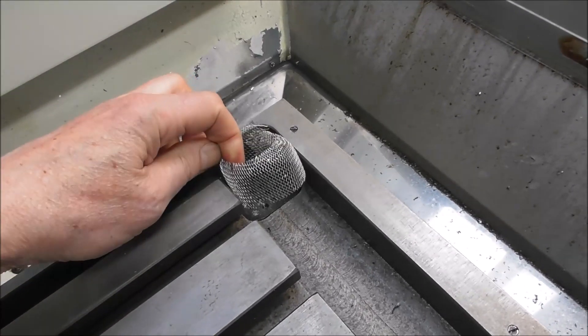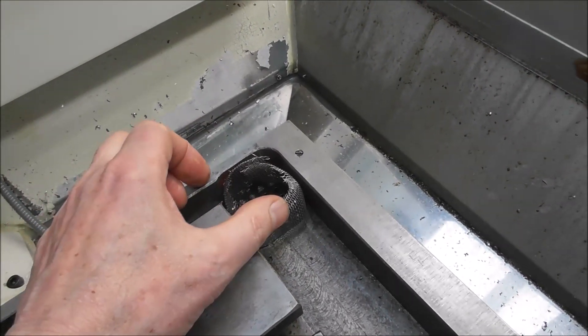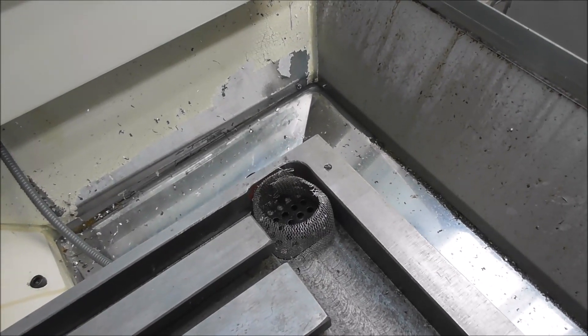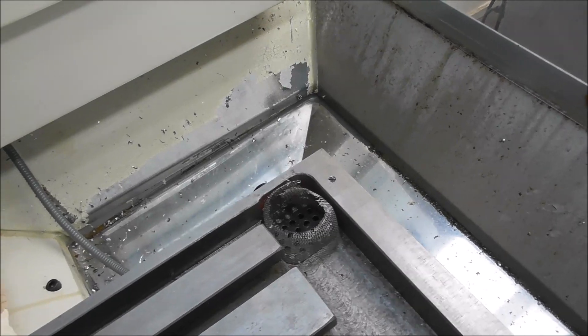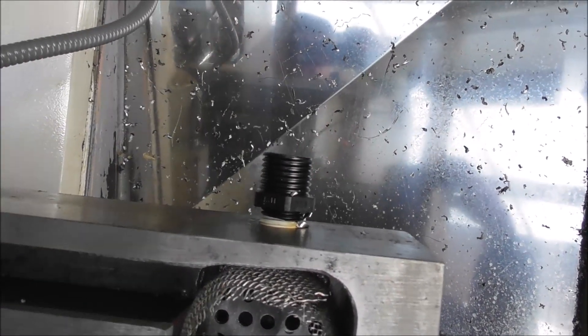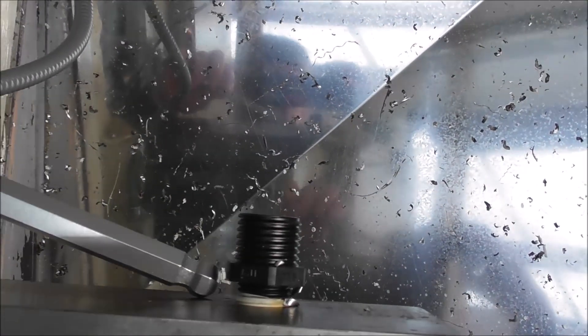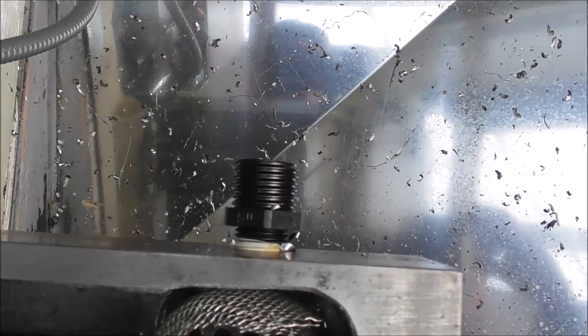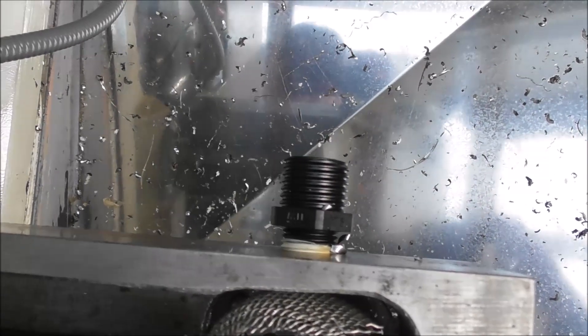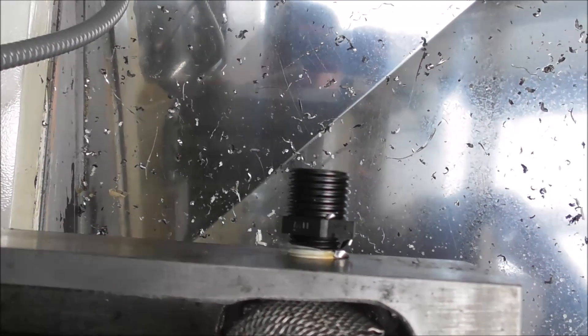It's a good idea to have a couple of little gauze filters above your coolant drain because it extends the time it will run and drain away before blocking up. Also down the back, screw in or glue on a couple of extension sleeves, because otherwise the coolant will dribble out and with surface tension run around underneath, carrying abrasive particles onto the slideway and eventually into the Turcite coating, causing it to wear much more rapidly than if the coolant flows clear of that area. Thanks for watching, cheers.